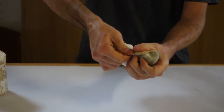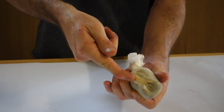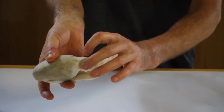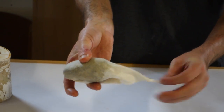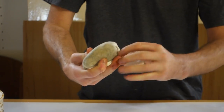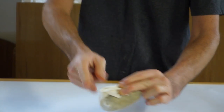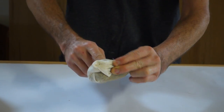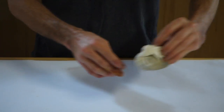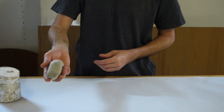Holding it tightly with my other hand as I go. Once you've got that nice and firm across there, you can transfer it into your other hand like so, and then we have to tie up the back of the rubber. That's simply done by twisting it one or two times, then pulling that last piece back across the top. That way the face of the rubber is tightly covered and you've got no loose bits of cloth getting in the way when you're polishing.